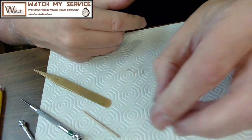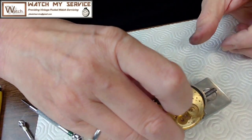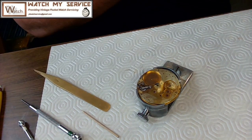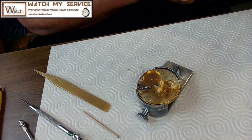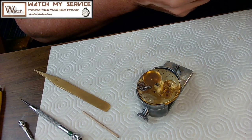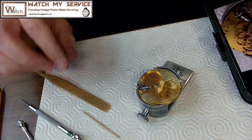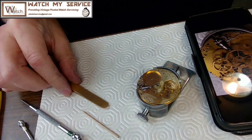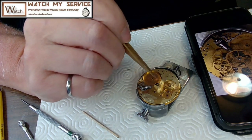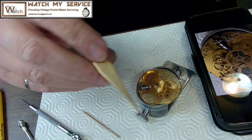What I did was take the notch on the arbor and put it ahead of the hole in the mainspring — it's curved anyway, like a ramp. So that's the best way to do that. Now I've got the majority of parts needed to reassemble this watch. I'm going to take a look at my picture first and make sure I've got everything accounted for for my reassembly. The wheels have to go in the right way.